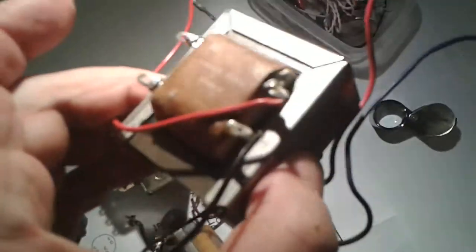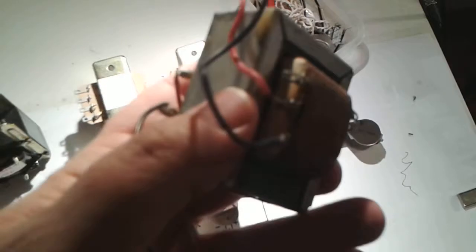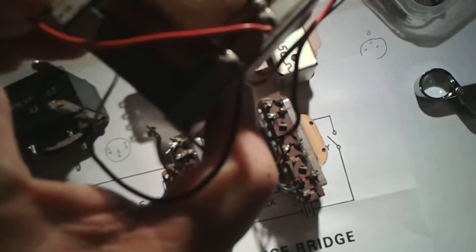Then I have this stand-core one, but I'm pretty sure it's not for a tube amp — I think it might be for a PA system. It measures out to around 100 or 200 ohms, with outputs of 4, 8, or 16 ohms selectable on one side, and the other side gives watts: 25, 15, 40, and 50. When I measured the resistance it wasn't anything like the other transformers. It's numbered as dash-8079.